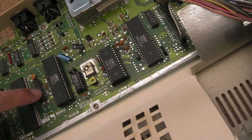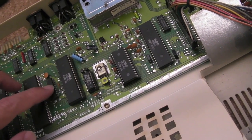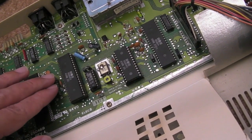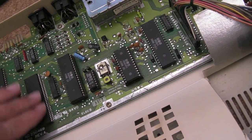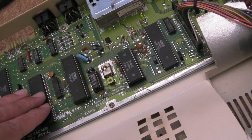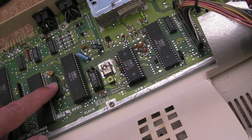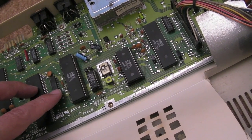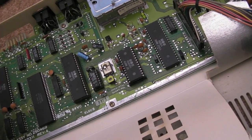But having then seen the corrosion on the pins there, I'm suspecting it's more likely a red herring - I think it's causing some problems with the addressing, probably from the failure of that chip, but I don't think it's actually a PLA fault. So before I do anything else, I'm going to take this to bits and have a look at this chip underneath the board. I'm going to potentially remove it, check the traces, socket it, and maybe give it a retry once I've cleaned everything up - maybe it'll work.